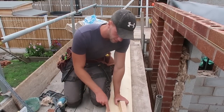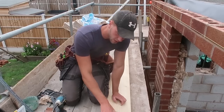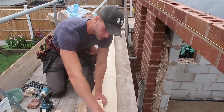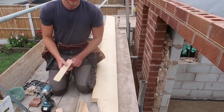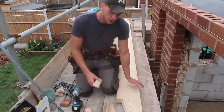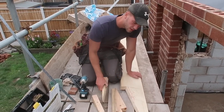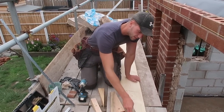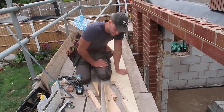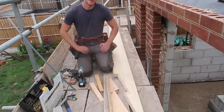So basically I've gone 2 inch down, and gone diagonal 2 inch there as well, and then you draw out your scarfing joint, and that gives you that there. And you want 2 inch for here where the wedge is going, so you draw out the 2 inch there, and then halve it, so that when you put the wedges in, you pull it together.